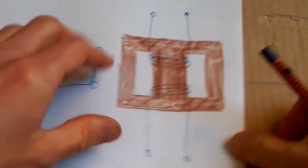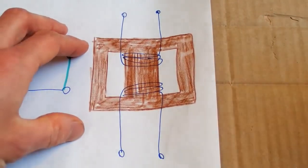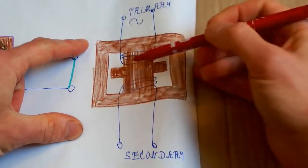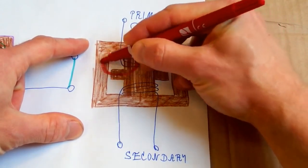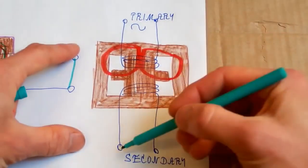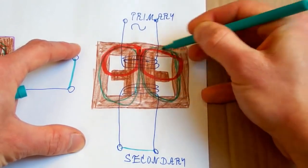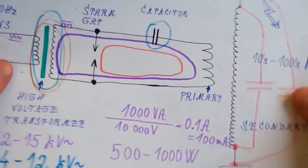There are various shapes of transformer cores. A normal transformer core looks one way, but if it has magnetic shunts it may be shaped differently — for example the primary flux can avoid the secondary through a shunt path when shorted, and follow the normal path when unloaded. So if you have this kind of transformer you already have current limiting built in.